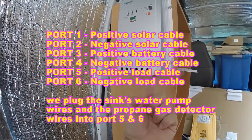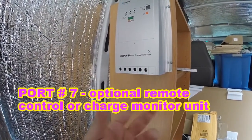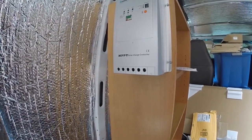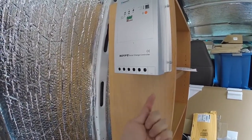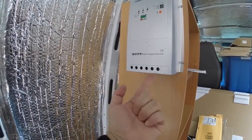There's also a space for a remote control - it's an optional piece of equipment with a jack that looks like a telephone plug that you plug into a telephone socket. But the three main connections - solar panels, battery, and load - are the only ones we really need to worry about.